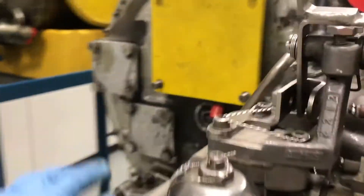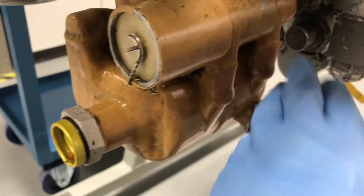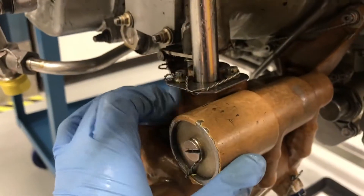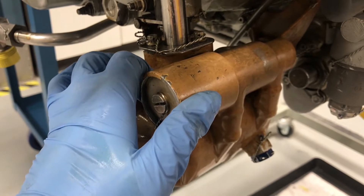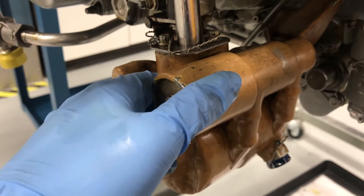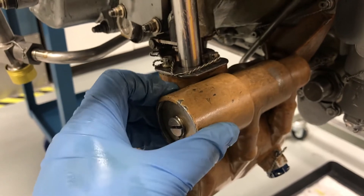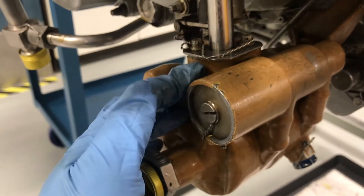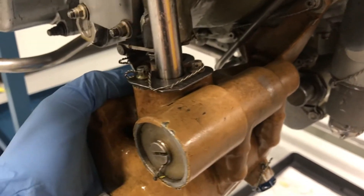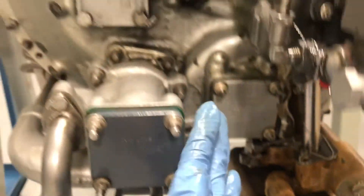Also, when the oil is cold, it needs to come to this component — from this section into this oil-fuel exchanger. It has two functions: firstly, it will preheat the fuel to make it easier and burn better. Also, it can cool down the lubricating oil. After the oil is cooled, it's gonna come through this tube back to the oil tank.